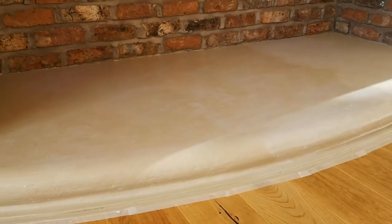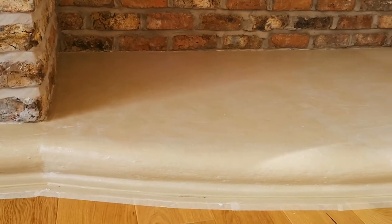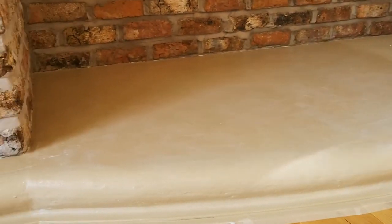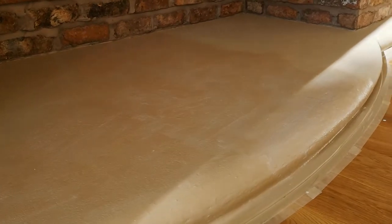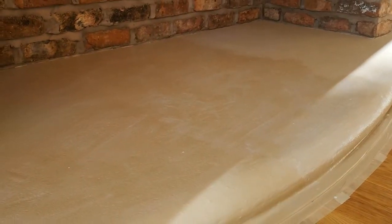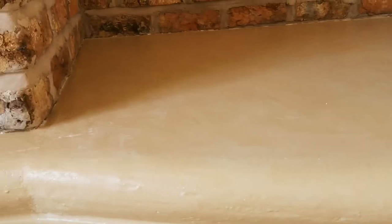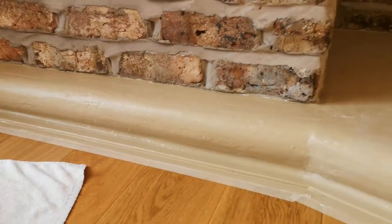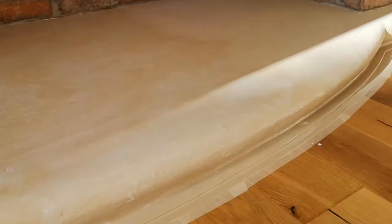The best example of this is when you're painting around a window frame and you've got so many glazed sashes, you can get lost and forget what you've just done and where you've got to do next. Where's dry? You don't end up overlapping where you've already done. So start from left, move over to the right. You can see I did that section first, done this section. That section's just been done, so it's still wet. Hence this bit of white on there, that's just the varnish.